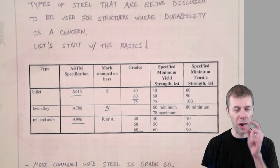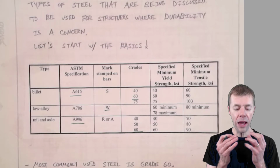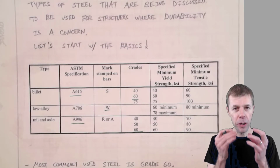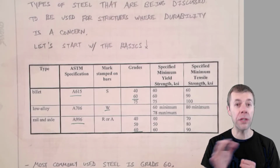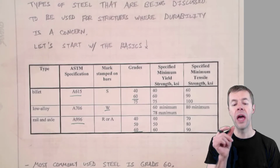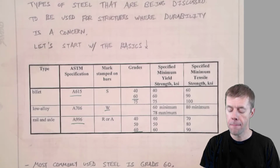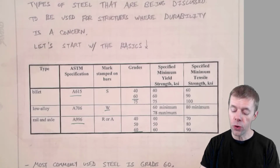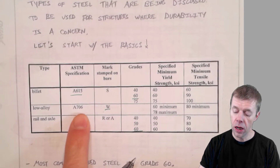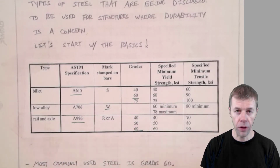The steel of that rebar, okay, is carefully controlled, and it makes it much, much easier to weld. That doesn't mean you can't weld any rebar, because you can. But a weldable bar is a weld you can count on. A weld that's going to have fatigue strength. A weld that isn't going to just break easily on you. So if you need to weld rebar, then you need A706W steel. Again, it's got 60 KSI, and you would design it similar to the other ones.